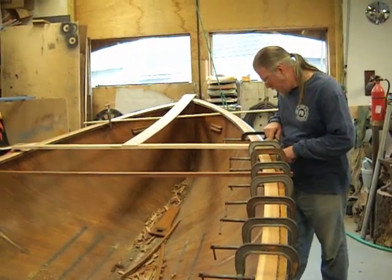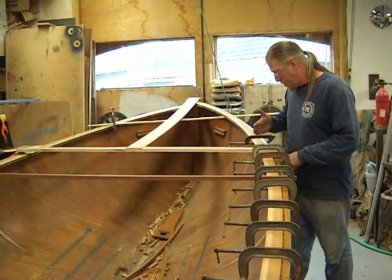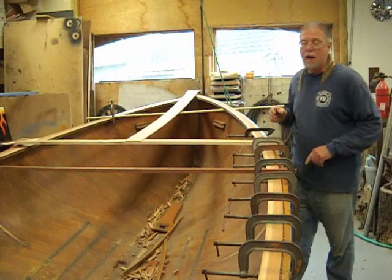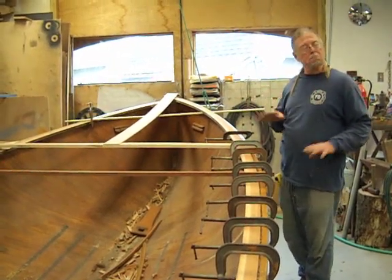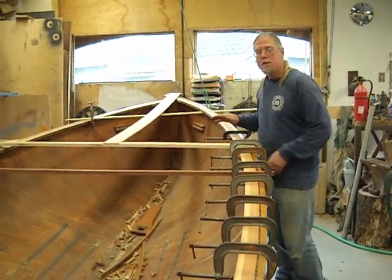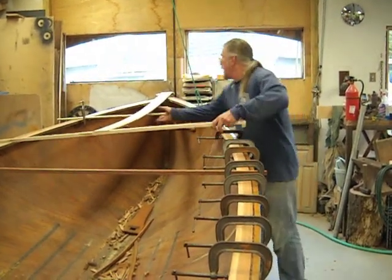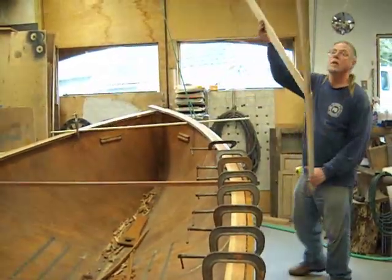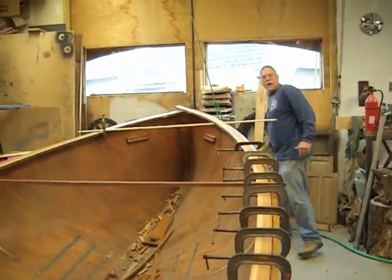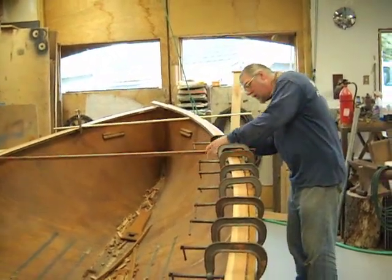So right now, our width originally was on the nominal, and now it's almost at the max. It's in between nominal and max, which means it's moved a quarter inch out. That's fine. That's pretty close. As you can see, it still has a bit of movement, and that will get set eventually with the grading. So, we're pretty good on that. Just as a check measurement. And now, we can check where we start fitting up here, where the angles change.